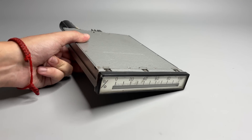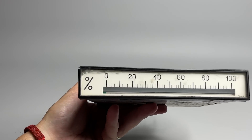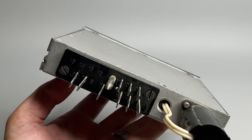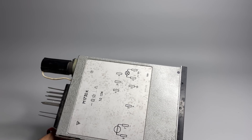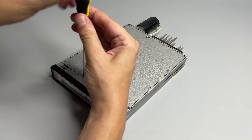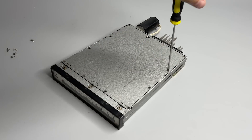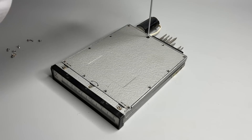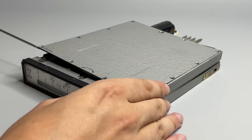Now let's move on to the most interesting piece of hardware — this meter. You will find dozens, if not hundreds of them in the reactor control room. They have a very narrow shape, which makes them convenient for stacking in large numbers. But they occupy an unusually deep space inside the panel because of the technology that requires this size. The upper cover is secured with an enormous number of screws because the device is well protected from moisture — apart from nuclear power plants, those are also used in marine environments.